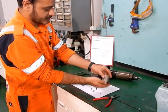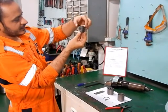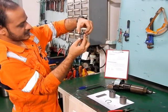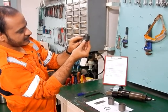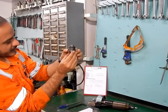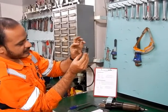Now we can disassemble it. Here you can see we have several springlets. You can see three of them, and then there is a gap, and then there are more springlets. So these two springlets are opposite to each other. What is happening when you are tightening from here is these two springs get into metal contact with each other, and they become flush with each other.